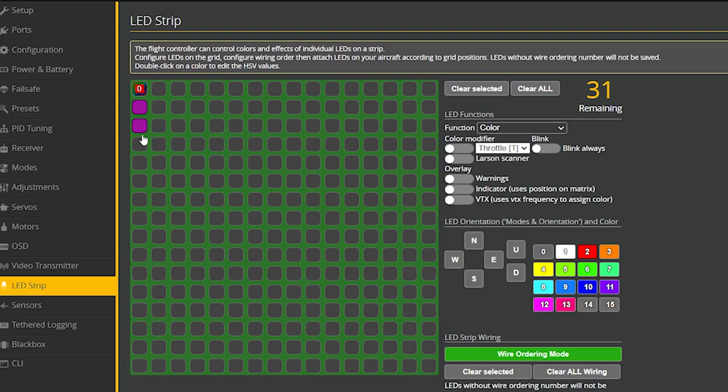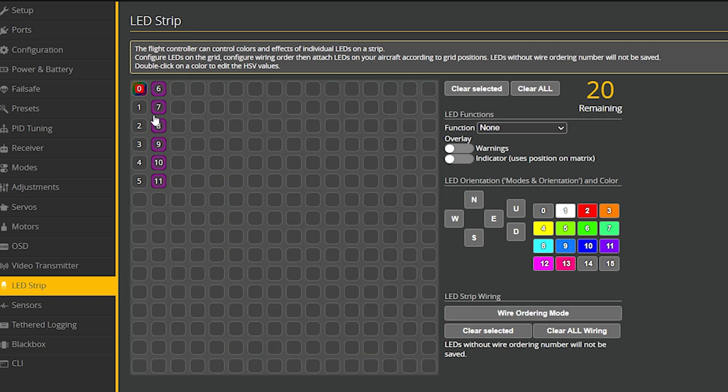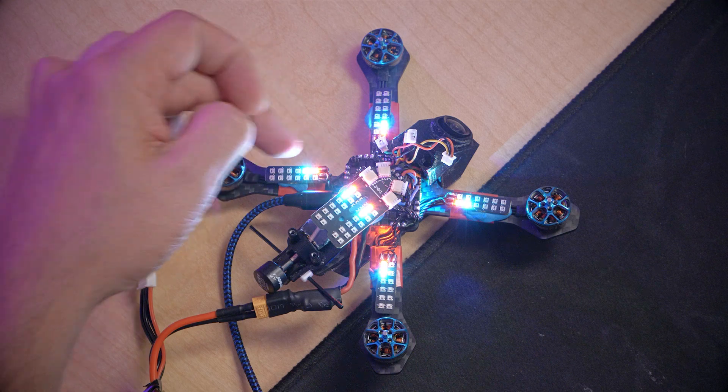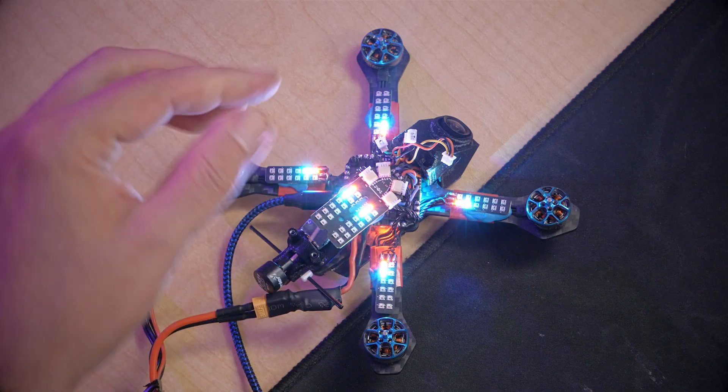When I turn on LED number zero, the top left LED in all of these panels lights up. We'll just click and drag and lay out six LEDs here and six LEDs here, which roughly matches the layout of our panel. Then click on LED number one, set the function to color, pick a different color, and hit save. Sure enough we can start to see the pattern — we have 12 addressable LEDs and all the individual banks of LEDs are in parallel, which means they're all going to look the same.